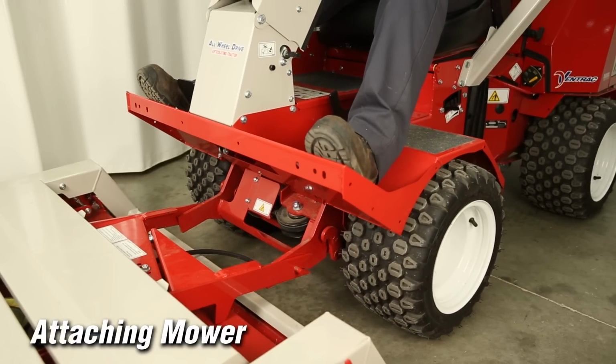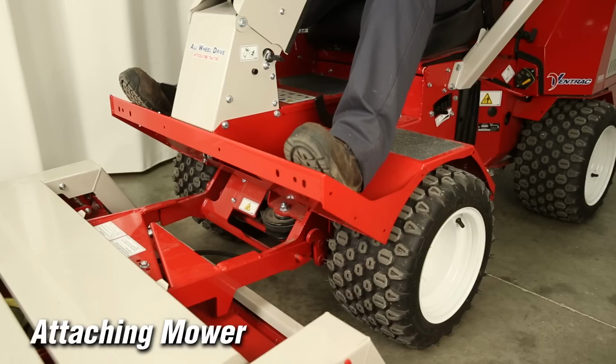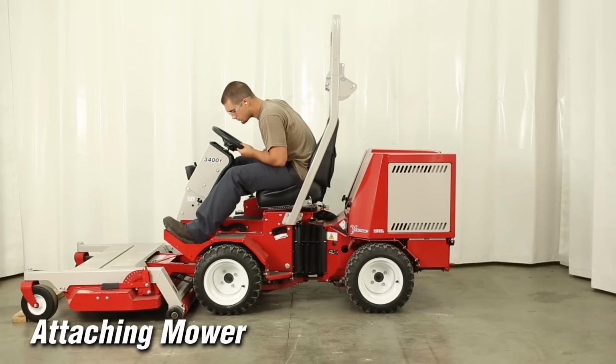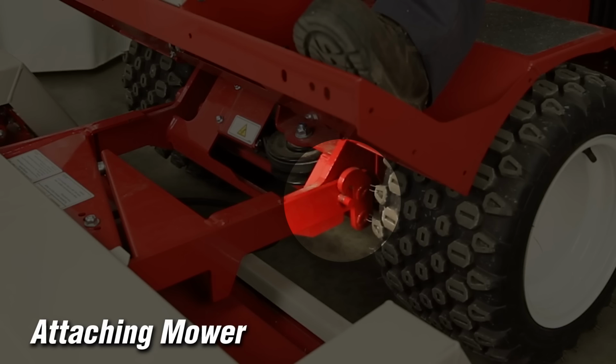Once the tractor hitch has moved past the lifting tabs on the mower hitch arm, as shown here, raise the front lift until the tractor hitch and mower arms are parallel with each other. Continue forward movement while at the same time ensuring that the attachment arms enter into the space between the hitch arm and the locking hook as shown here.